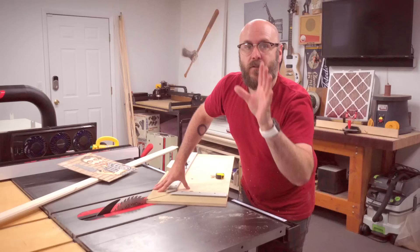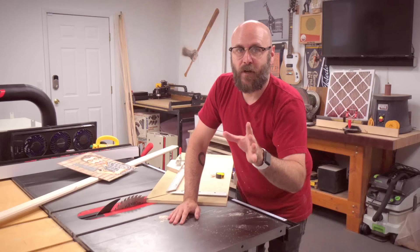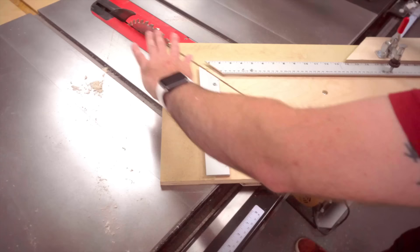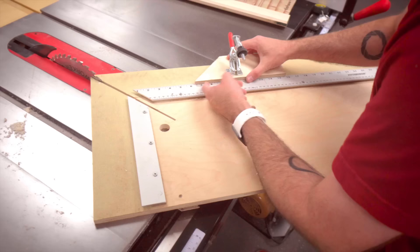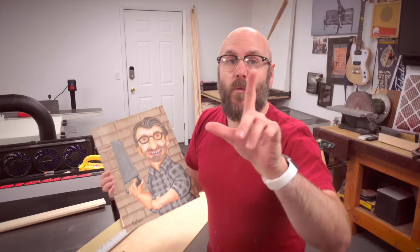The first picture frame I'm going to make using the jig, and then I'm going to make another picture frame without the jig so you can see what's involved. We make one cut on the left side — there's sandpaper on there so the piece doesn't slip — and then we move it over to the right side to cut the other side. One more thing: you want to add one eighth of an inch to your measurements, just to give the artwork a little bit of wiggle room.